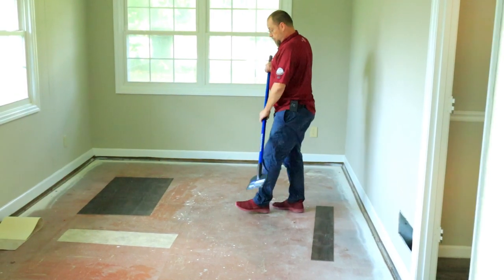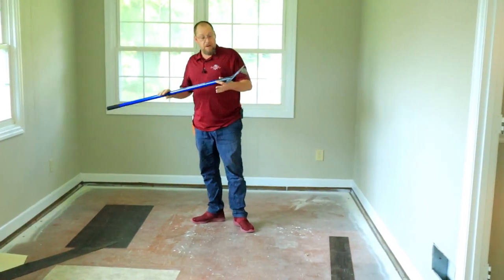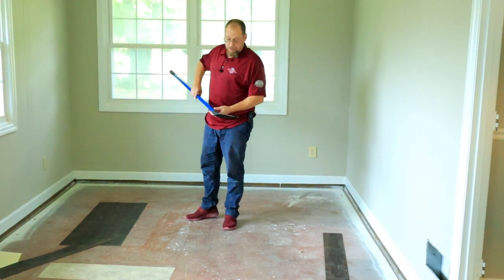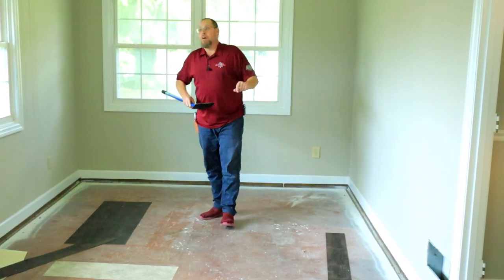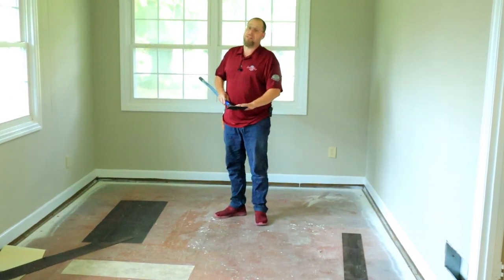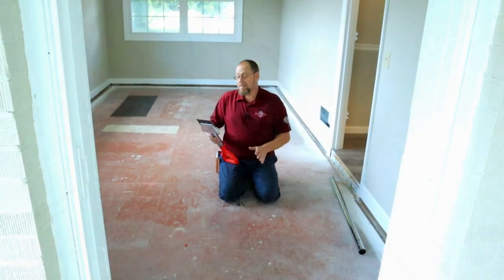This is proving to be a really nice scraper — done really well on the vinyl plank as well. Marshalltown, just like Gunlock, you have surprised me. I thought it was going to do great on tile but not so good on vinyl, but it proved worthy — it did really well on sheet vinyl and all through these products. If you need to slice up some glue or old felt-back vinyl this probably isn't your scraper; you'd want a razor scraper for that. But for overall demo, this one is key.